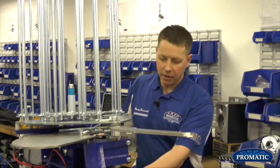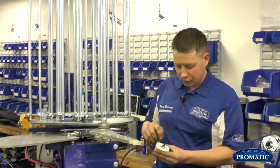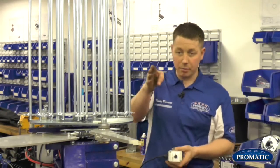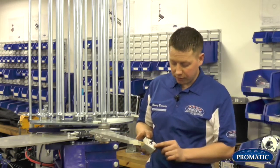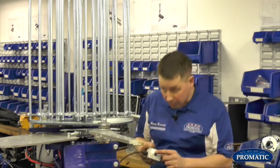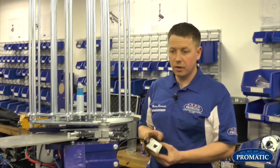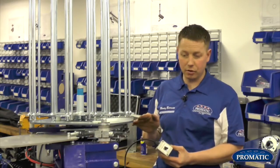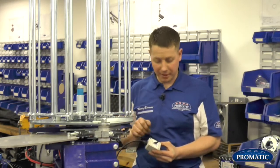And then what we have on the disarm position, this is the most important thing now, because we're going to be making the machine live. So we have disarm, nudge, off, and arm load. You'll see at the moment the arm is sticking straight out of the machine. It is on off at the moment, so we'll take it to arm load, which makes sure there's nothing in it. Arm load. Okay, this means the machine is now cocked, which is in a dangerous position. So we'll always operate from the back of the machine.